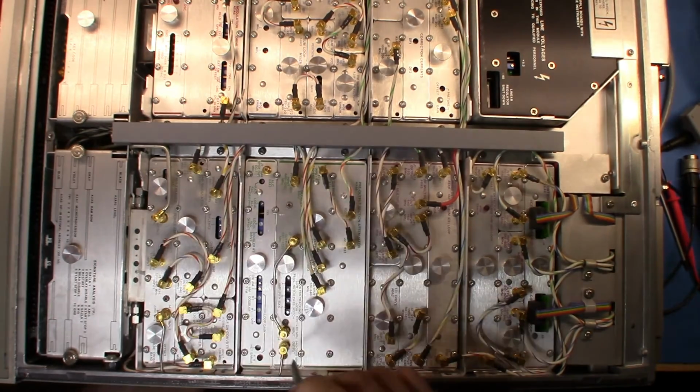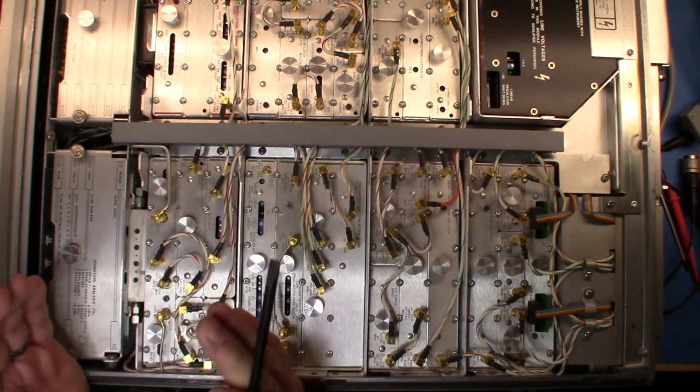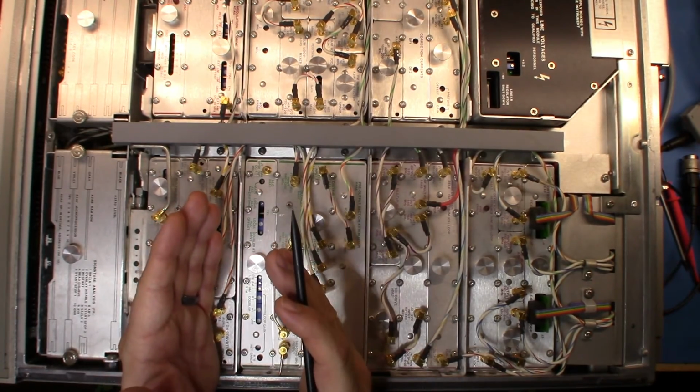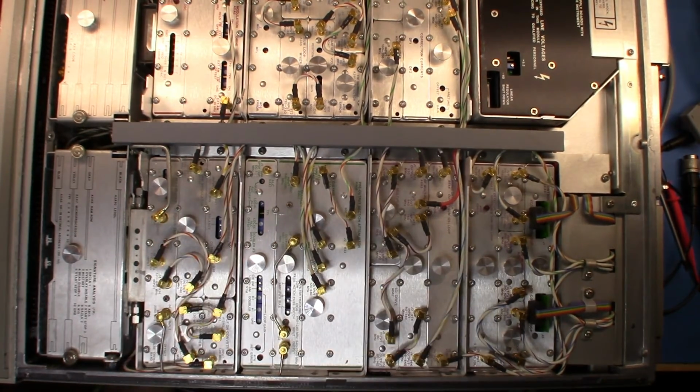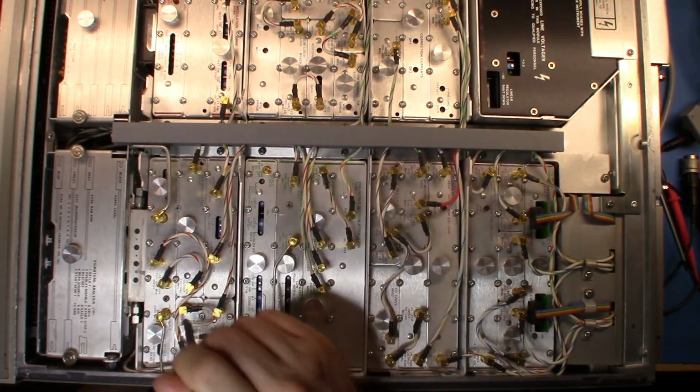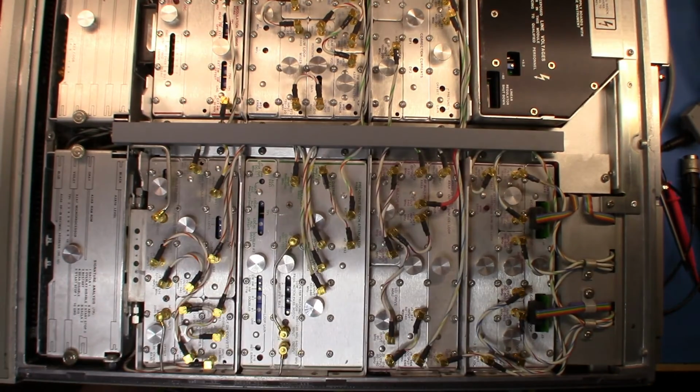So that's how the circuit is basically a VCO that operates in a fairly small range of 320 to 640. And then it's being doubled and down converted throughout these areas here that then will put it out and, you know, give you the resultant signal that you're actually after.